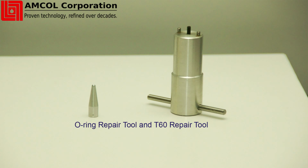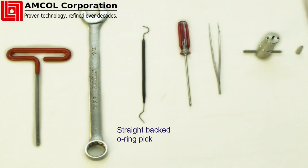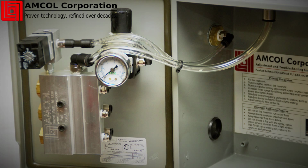You will need two special tools to complete this rebuild: the T60 repair tool and O-ring repair tool, which are available for purchase from AMCOL. You will also need a clean, dry working area with a benchtop vise, a 3/16 Allen wrench, a 7/8 inch wrench, a straight-backed O-ring pick, a screwdriver, and tweezers. It is a good idea to place a clean cloth or paper towel on the working surface to ensure a clean and dry working environment.